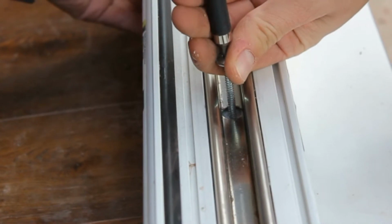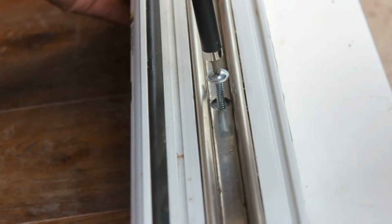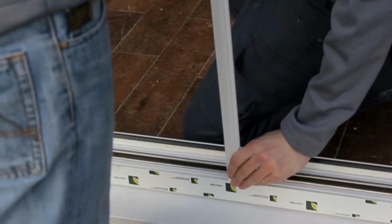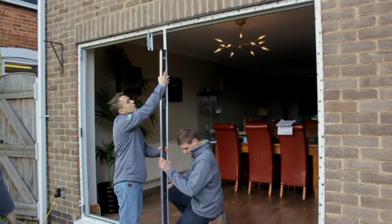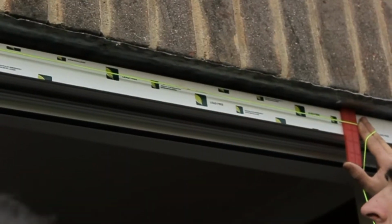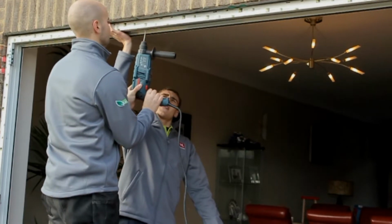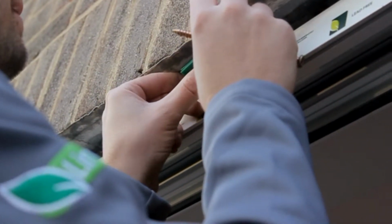Once pushed against the sill's rear upstand, the threshold can now be fixed into place. Use appropriate fixings to secure down through the pre-punched drainage holes into the PVCU sill. A timber lat can be used to help ensure that the head is installed parallel to the sill. Fix the head into place, completing the outer frame installation.